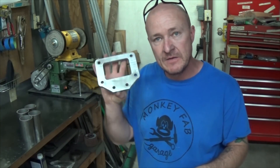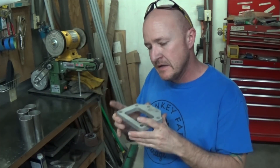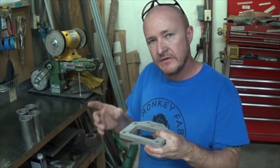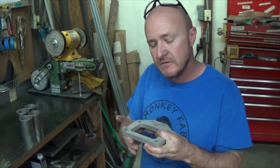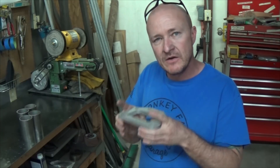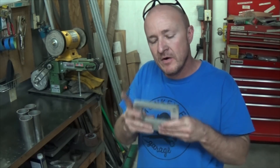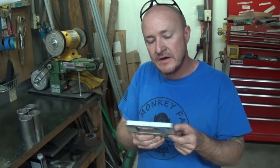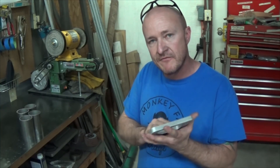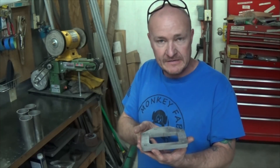What I generally do is I'll surface the back side of the flange that's going to be mating with the turbo, and then I'll chuck it up. I have an aluminum purge block that I use — it serves a couple functions. Number one, it helps pull the heat from the part so it doesn't get too saturated with heat, and it's also used to fill the back with purging gas. I generally let it cool, just set it down and let it cool to room temperature, and that helps limit the distortion. But stainless is crazy reactive with heat, so when I take them off and sand them again, I always notice they're not flat anymore — they've warped.